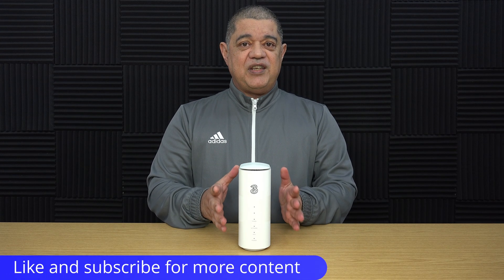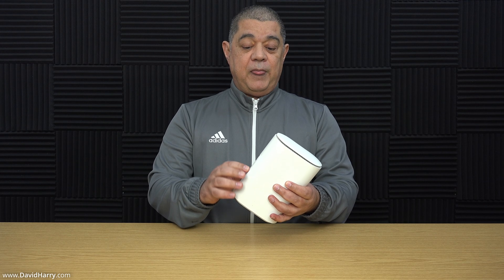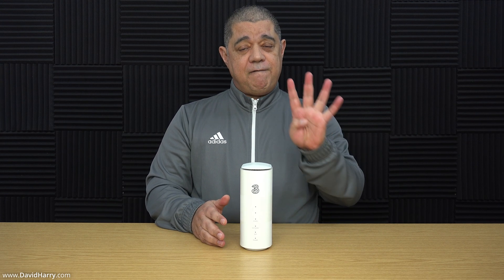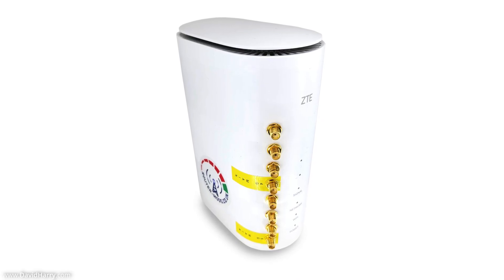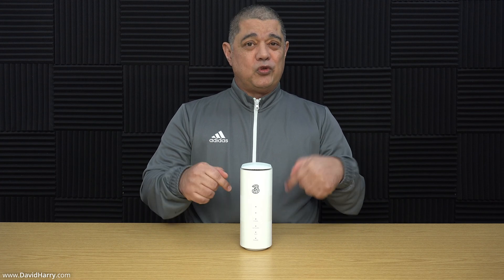What I've got here is a ZTE MC801A, which is a 4G/5G router. Anybody who's got one of these will know it has two ports on the back which are TS9, basically extending just two of the 5G antenna ports to external antennas. What I'm going to get done is an eight-port modification — four SMA ports added to the front for 5G and another four SMA ports for 4G, so I can connect all of my outdoor external antennas to the router.